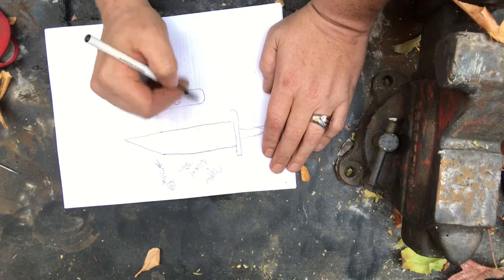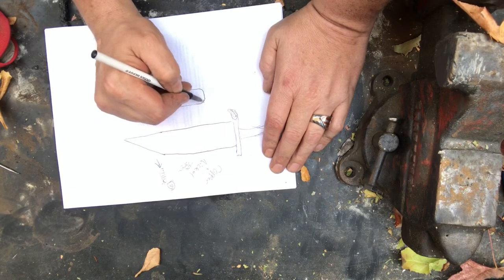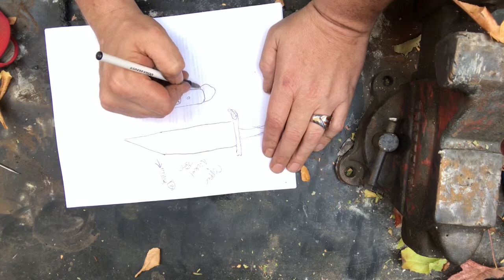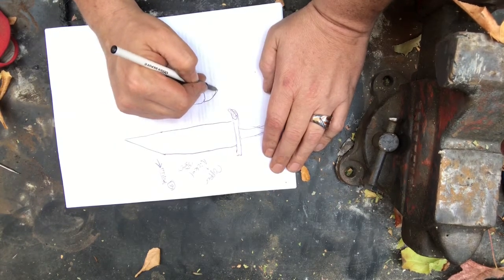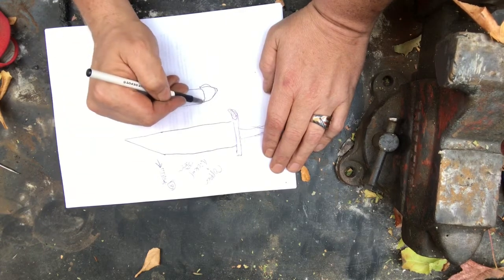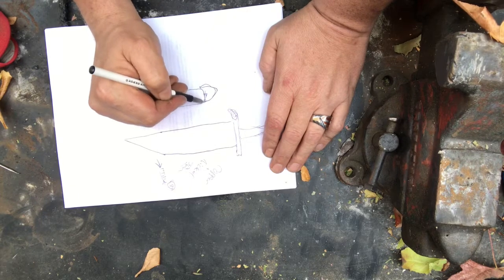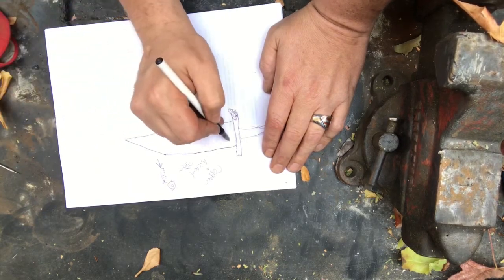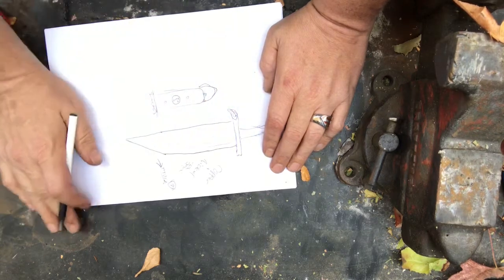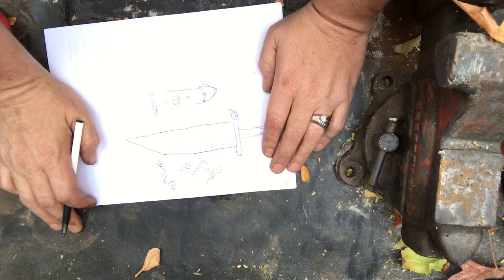And then I'm going to either do a pommel or a butt cap. I'm probably just going to do a butt cap, but it's going to be the same as this right here. It's going to be the mokume, but I'm gonna try to teardrop kind of shape it so it's more of like a skull buster. I don't know, it could just end up being, you know, just a little butt cap. That's a tang right there. So, and then I think I'll try my first fuller, which will run this way on your knife. So, that's my plan.